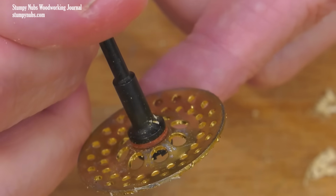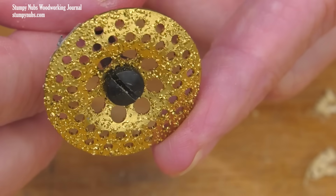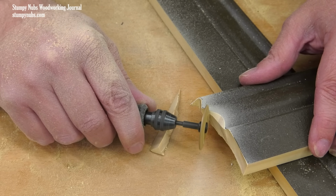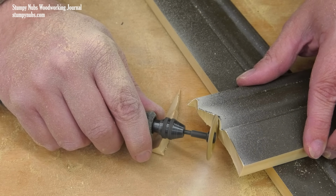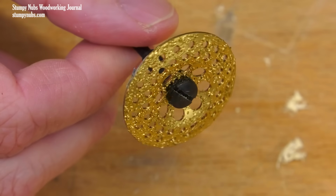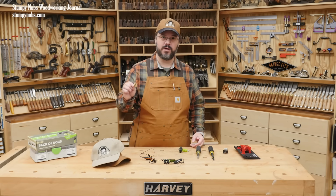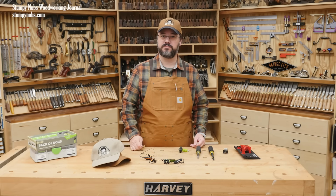This allows for some small angle adjustments when it's installed and the two pieces are put together without opening up a gap. The coarse carbide on the bit removes material faster than a diamond cutter, yet it's going to last just as long. And it's not just for coping. I use the same bit for all sorts of trimming and shaping of wood, PVC, composites, you name it. It's one of the handiest bits I've ever found, and it comes from a small family business called Duragrit that is definitely worth supporting. As you know, I just like to support small businesses whenever I can. So seriously, get one and see how much more you end up using your rotary tool. You'll find a link below the video.